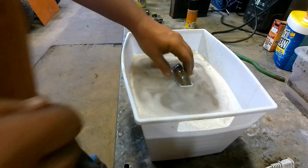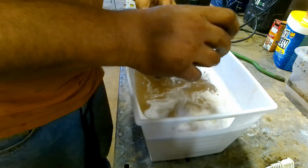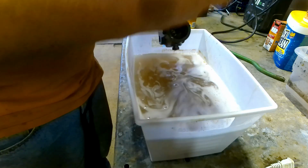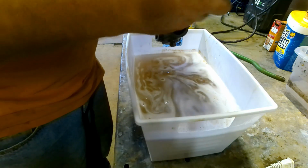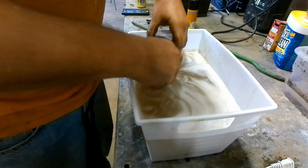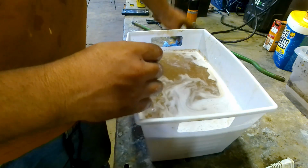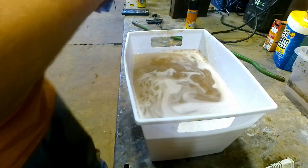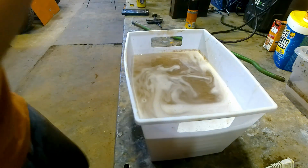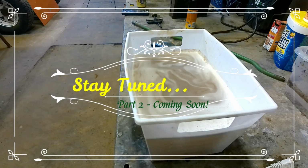Okay guys, so I got the bowl finally apart. It was being a booger. So got the float here. I think the float's good. The way I'm going to test it is to put the float back inside of the unit and throw it down there, so it's completely submerged. When I come back tomorrow, we can shake it around. If we hear moisture inside of it, we know that the float's busted. So that's going to be it for today, and I'm going to go ahead and get some parts ordered.